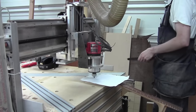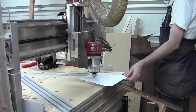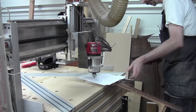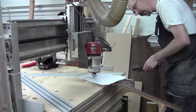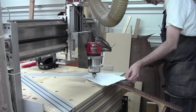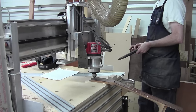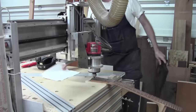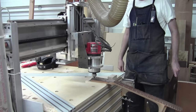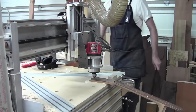I'm just going after it. This is a one-time, one-shot deal — if I screw this up, I'm peeling that headstock plate off and making another one. Getting closer, getting there, and we'll just get it zeroed here. Still too far. Close there — and we can call that the Z zero. Now I'm just going to run this; it literally takes like a minute or two. The double-stick tape is holding it, and it shouldn't peel up because the locating pins are keeping that from happening. We're going to call it good and run it.